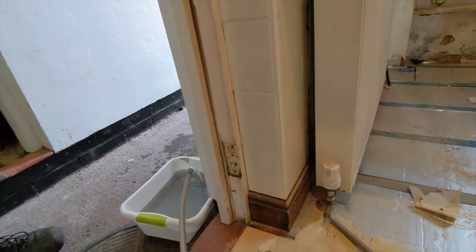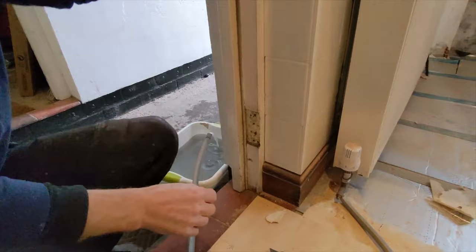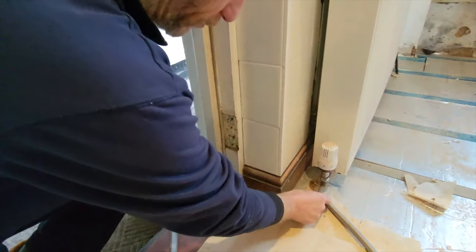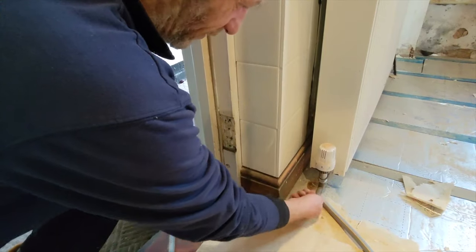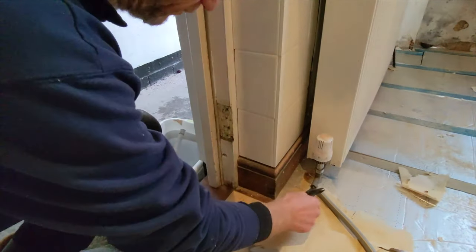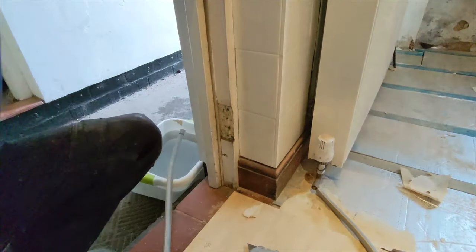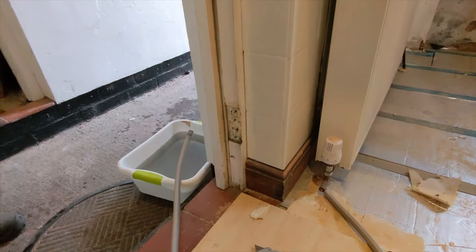Can you actually do that, or is it only some radiators you can do that with? I wouldn't want to do that, because you might damage the pipe. These are only soldered joints, and if you put too much pressure on them they can split. It's far easier to just drain the system. Plumbers do it day in, day out — that's all they do.